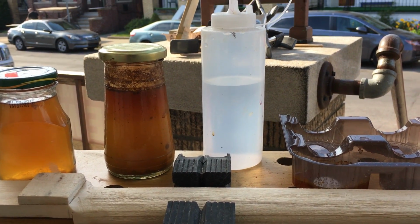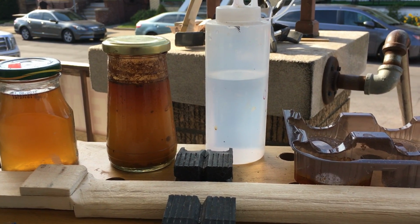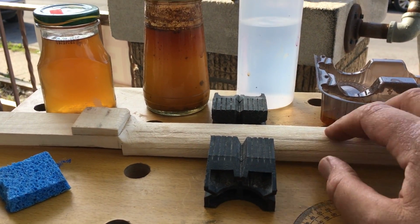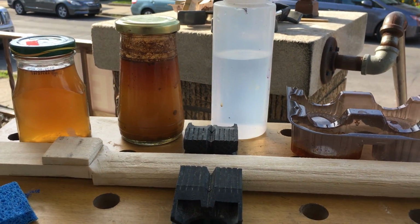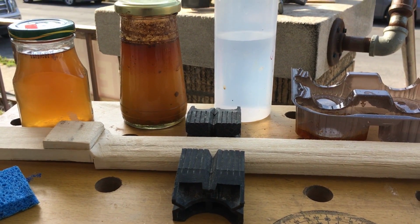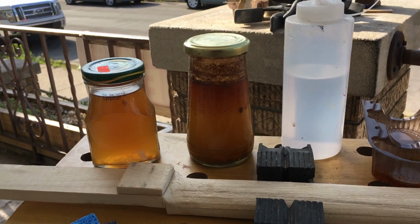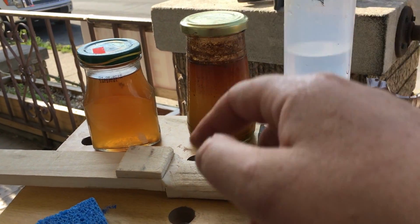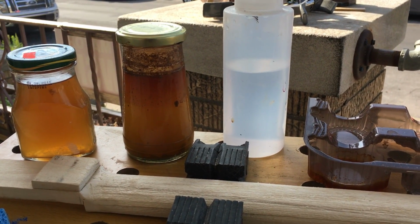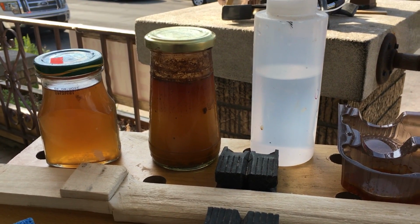I threw out, it was sad, I threw out stuff that just couldn't be rescued, including a couple of spoke shaves that, God, I wish I did. The rest of it I threw into a couple of the surviving toolboxes and left it up until about a month ago. Anyway, basically this bottle is vinegar and the rusty tools that have sat in a bucket for about 3 weeks. I'm going to let the tools sit for another week and then get at them with the wire brush.